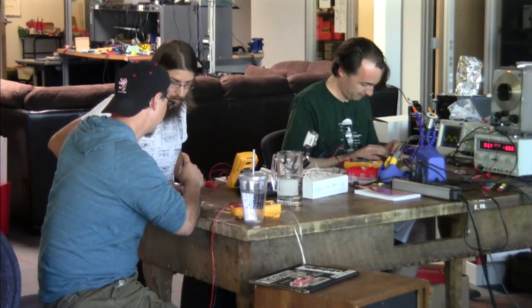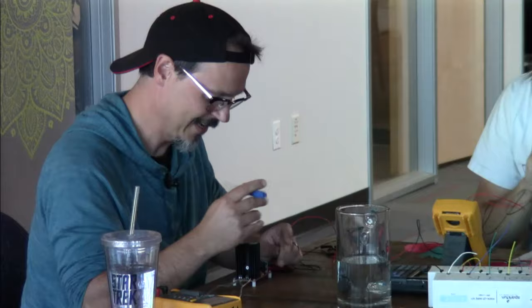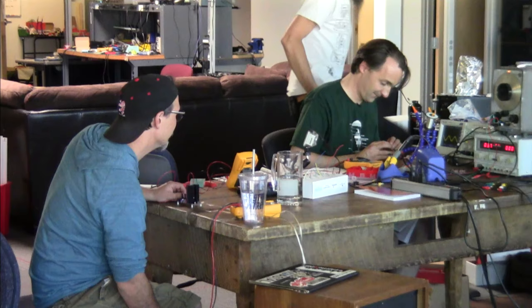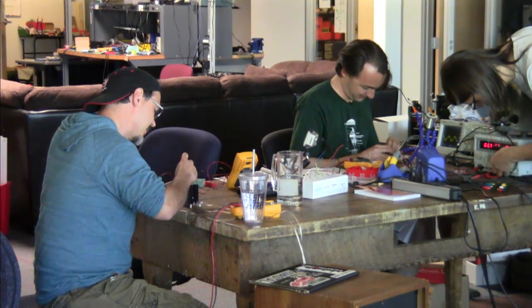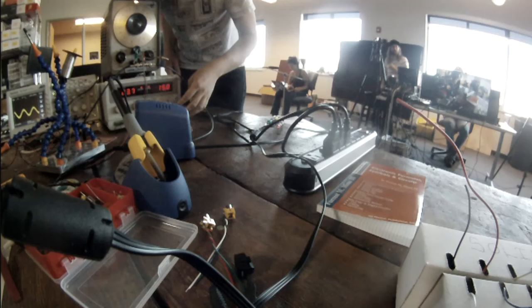Are my wires plugged in anything yet? Okay, cool. Nope. Just setting. Can you set the supply to like 13 volts and limit it at about 150 milliamps? Sure. I'll just use two different supplies. Ooh, fancy. Super fancy. I have hooked plus and minus to the correct terminals.